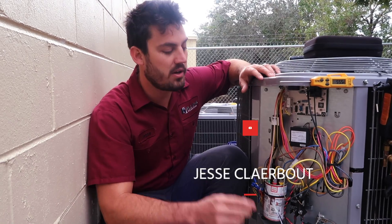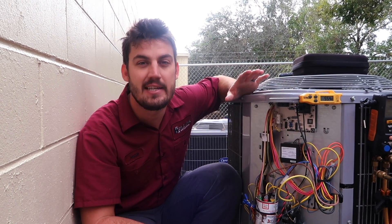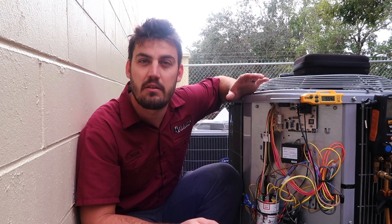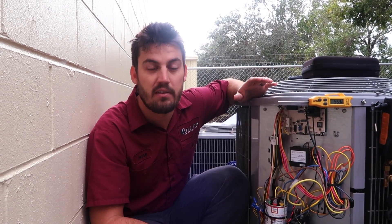I'm going to do a different video on that if you absolutely have no information. But in this video, Jesse's going to review with you how to use the Carrier manufacturer information in order to check the charge on a heat pump. So we're going to run the system in heat mode and get the pressures. Currently outside it's right around 57 degrees, and indoor temperature is right around 70 degrees. We're going to look at the chart for this particular Carrier unit and check it out.